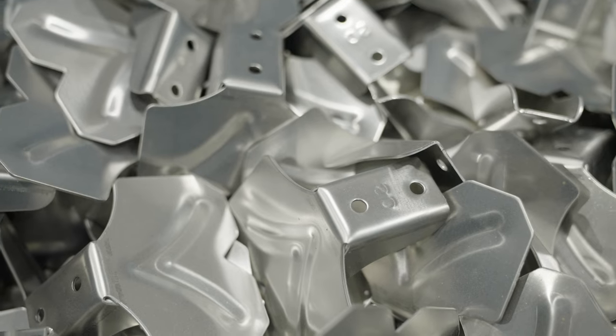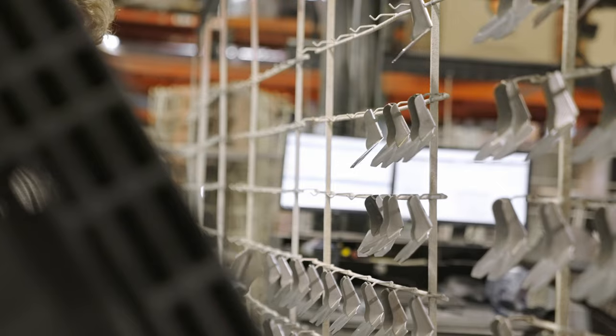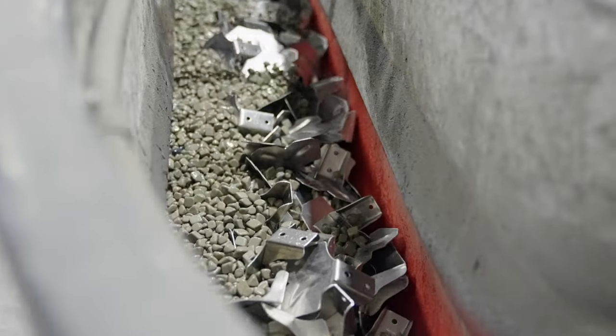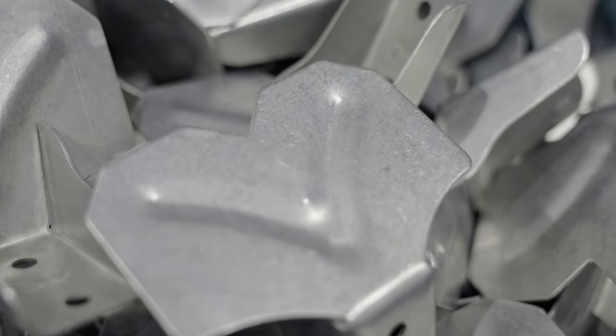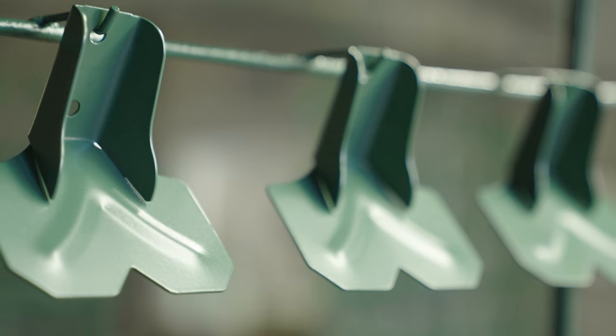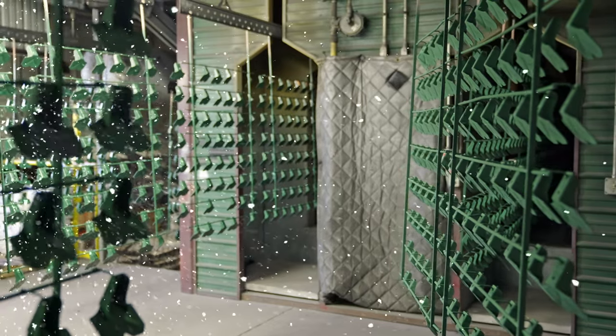What gives the stainless steel used in the Snow Defender snow guards its protection also makes it incredibly difficult to coat. It requires a special tumble process to prepare the surface. But once properly prepared, the powder coating actually bonds with the steel for an incredibly high quality and long lasting finish that you can't get with wet painted coatings.